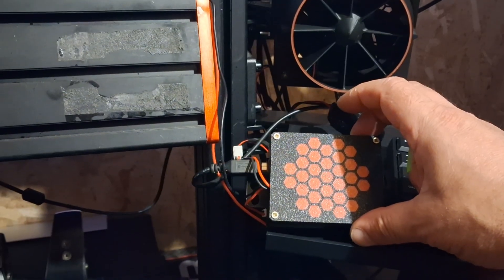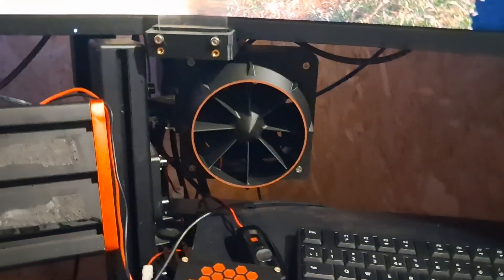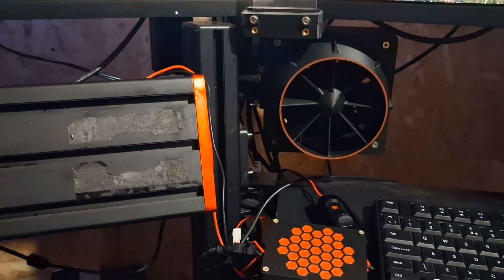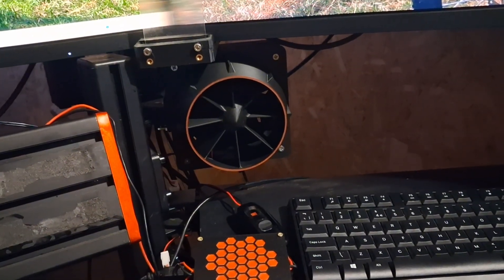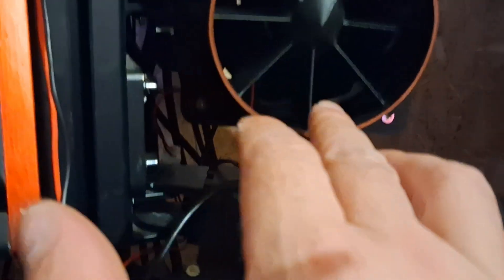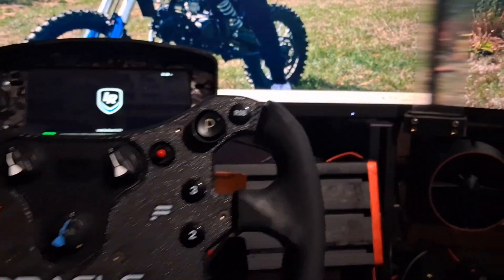When I get some T-nuts, that box will just face me on there, nice and neat. Everything's in there — the motor stepper and the Arduino R3 Uno. There's one of the fans. These aren't the fans I first showed you — these are the second ones I made. This is my rig at home. I've made two of these wind machines this week. This one has 38mm fans in, so these cases are a lot thicker at the back — around 40mm — housing 38mm fans. These fans move 193 cubic feet per minute of air, so they move quite a lot.